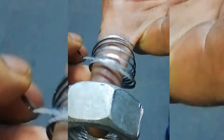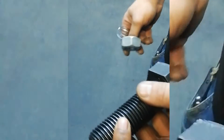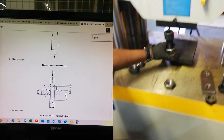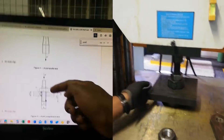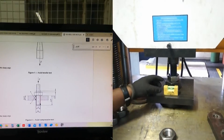The whole thread came out — that's something to watch for. Usually we do it with hardened bolts, because we can use the hardened bolts or the mandrel, which is also hardened. This one passed the test. You apply the load, you're trying to separate the nut from the bolts or the mandrel, and remember the mandrel is hardened while the nut is the one being tested.